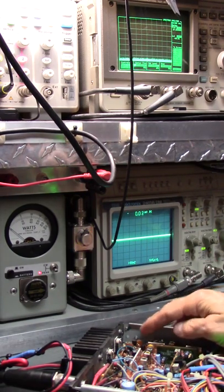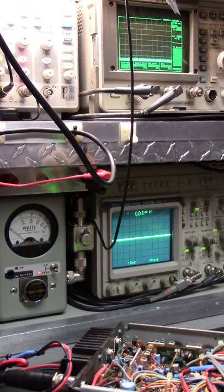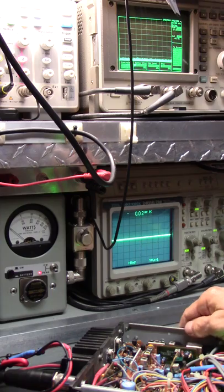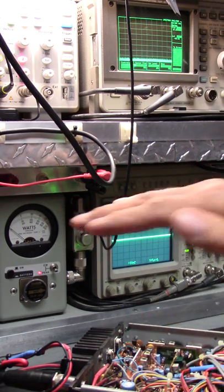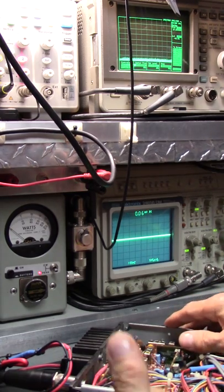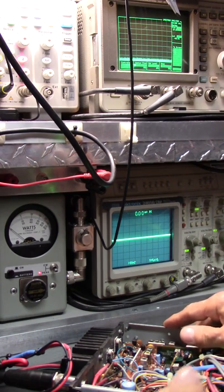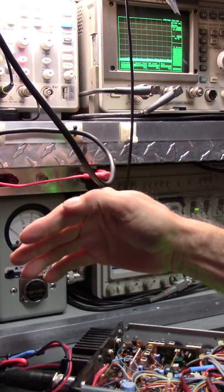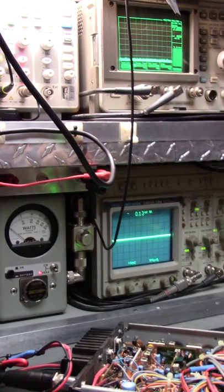So this little thing right here would be like you have, I don't know, a Pro 510XL or Cobra 29 or this radio. And then you have it going into an amplifier that's capable of taking the signal from the bottom to the top, proportional. You know, say if this can dead key 4, swing 12, the input of the amp takes 4 and multiplies it to the size of your next amplifier and then your big tube somewhere else. And it would end up looking exactly like that. Spectrally pure.